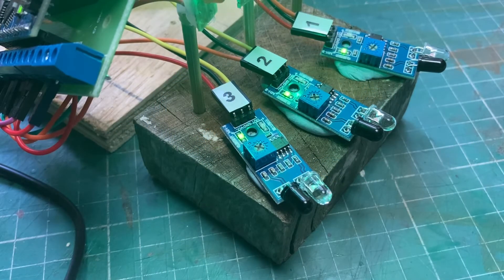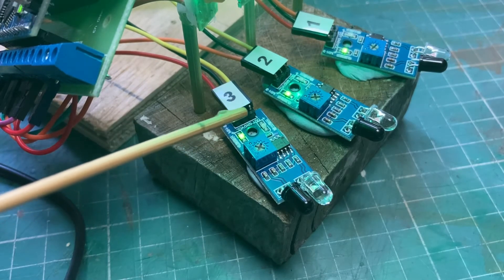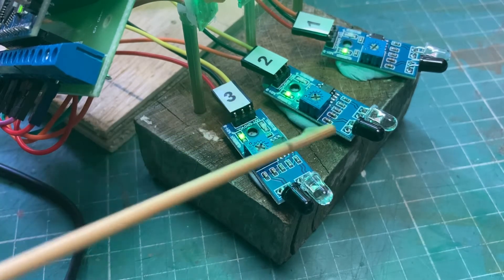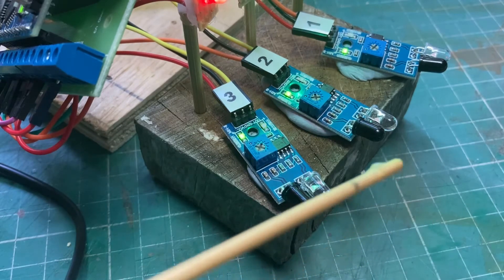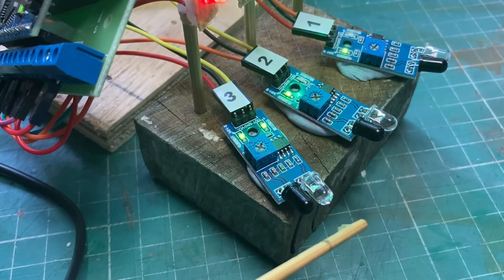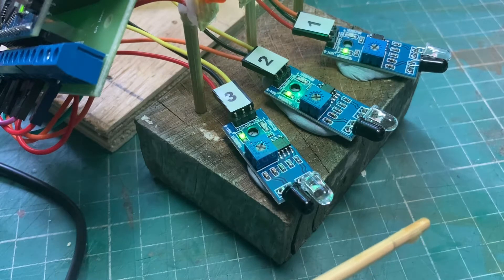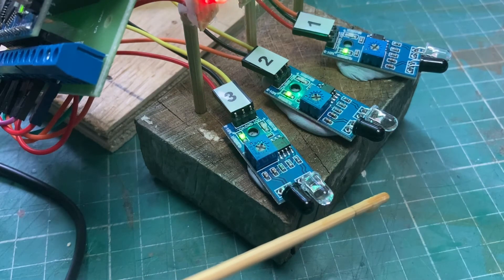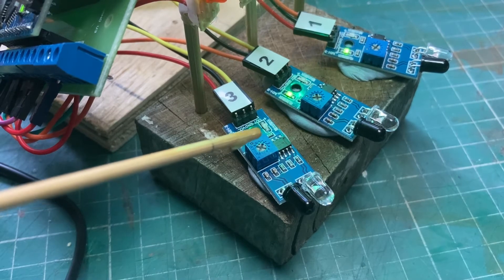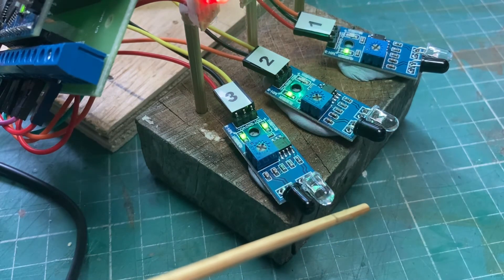Just one tiny thing before we do anything else. There is a potential issue you might come across when setting this up. I found this online. You know I mentioned the infrared sensors — they show a little light when a detection is made. I was having trouble getting the signals working, and I noticed that little lamp was on permanently, meaning it was continually detecting. That can be caused by a lot of ambient light — from outside or from your room. So if you see that light on permanently, use the little adjusting screw to lessen the sensitivity. If you see two LEDs on your sensor, that's the problem.